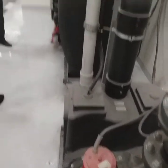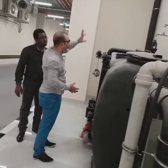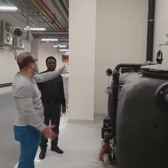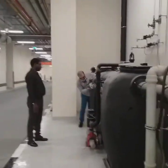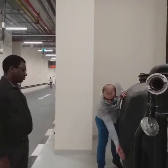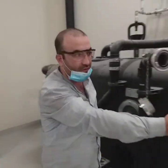Why does it have to be filled with fresh water? Again, the water coming from the kitchen is mixed with bones, grease, and clean water. So it takes place by specific gravity, where the water goes down, the grease goes up, the sludge goes down, and then the continuity will be for only clean water.